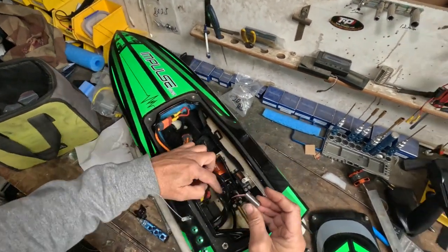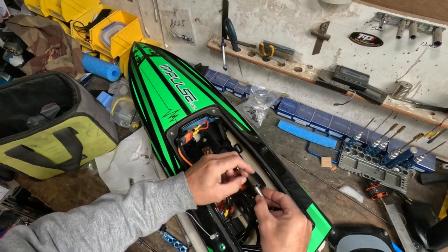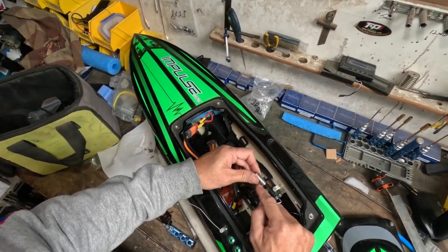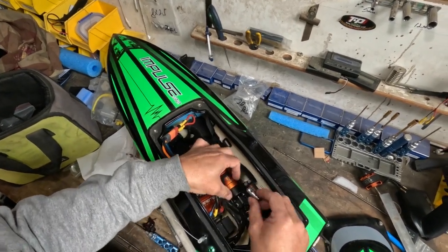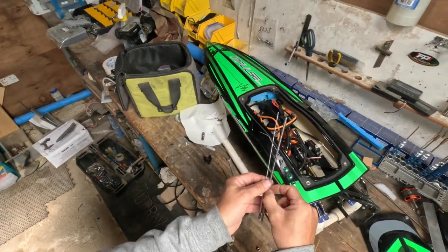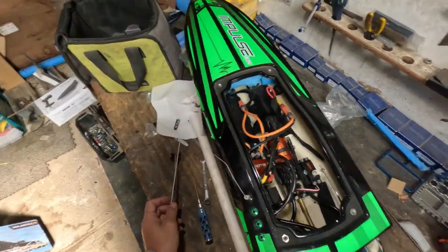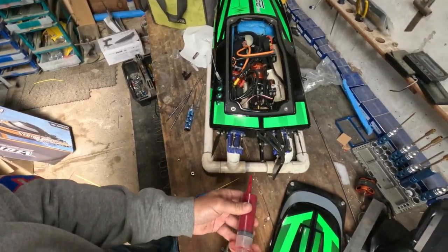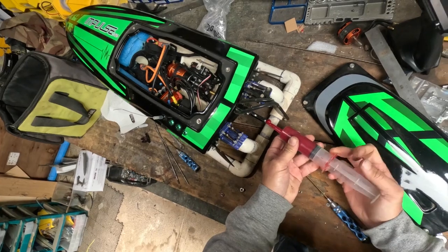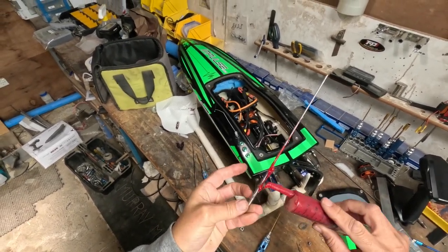Here's the joiner — you're going to replace the collet with this. It has a grub screw on either side. It only really needs one on the flat, but we put the extra one there for insurance. I've designed them with two screws on each side so you've got four grub screws total holding the cable, to make sure the drive cable can never slip. Now because you've got a much bigger gap between your stuffing tube or Teflon liner and your cable, make sure you've got plenty of grease in there. You can either grease the outside of the wire or pump it in. It doesn't really need it for lubrication, but it does stop water coming up now that you've got a bigger gap.